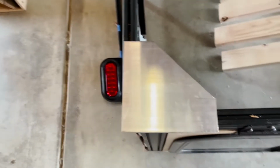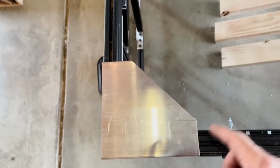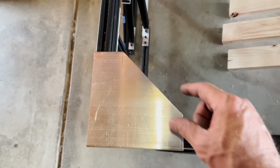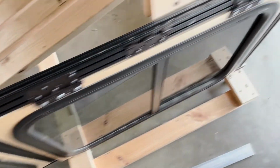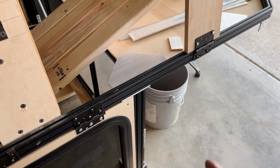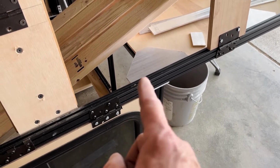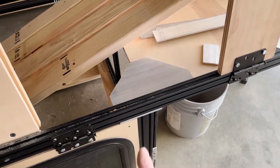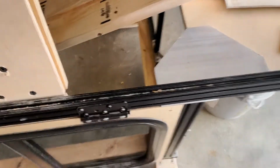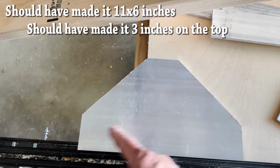Cut on the back side, 2 gusset plates, 6x6, and then a 2 inch by 2 inch left here, and then for the overcab, I want a gusset over here as well, over the main bar that's in the back of the cab. So this is a 10 inch, 2 inch by 2 inch by 2 inch.